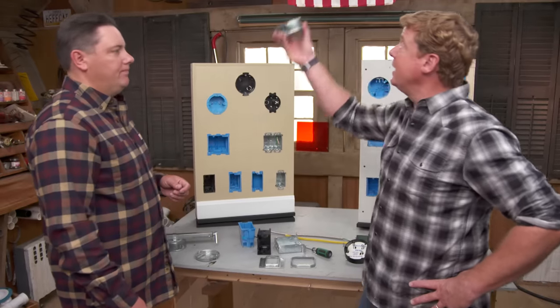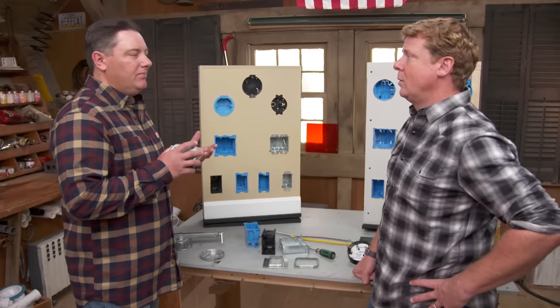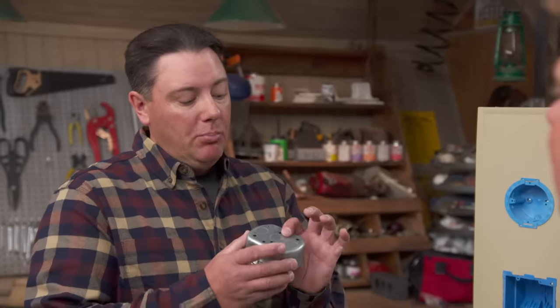And if we were going above head into the ceiling, different choices there? In that case, I actually prefer to use metal even with the non-metallic cable. I'd like to put something like this — a fan-rated box — that'll kind of future-proof things if they want to put a ceiling fan or a heavy light fixture. We'll mount this to the structure. A fan-rated box can carry more weight. So even if you're putting in an overhead light that's not heavy, you're going to do a fan-rated box just to cover ourselves. Then that would just go right into the structure.